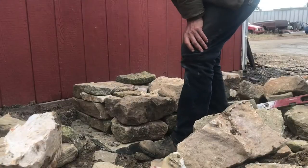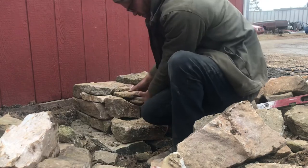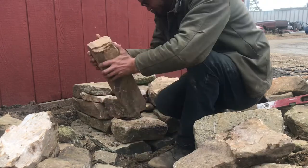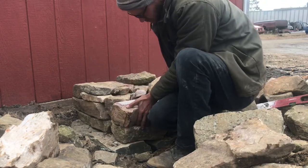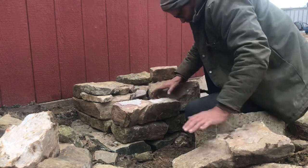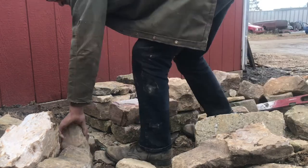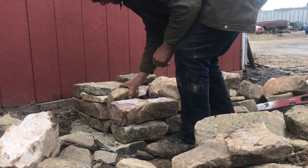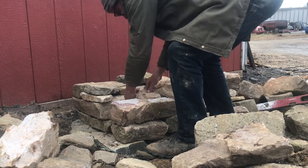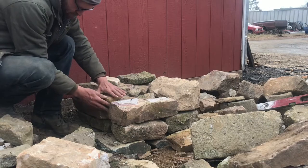The first course is really important. I start out by setting the corners and then I fill in any gaps. Columns can be built using two different methods. You can build with all the stones laid more or less flat, one on top of another. As long as you make sure you don't have any running joints you should be fine. Building this way has some pretty serious advantages — it can be built very strong with very little skill.